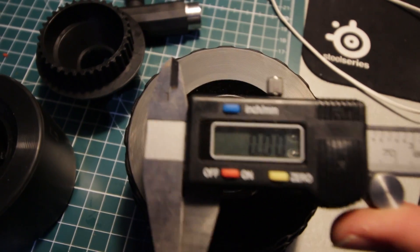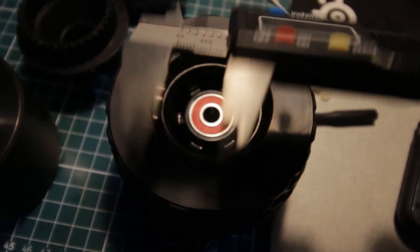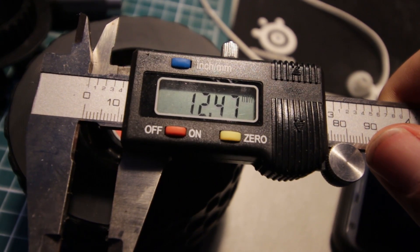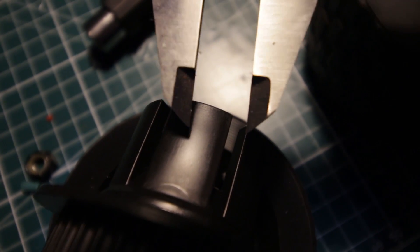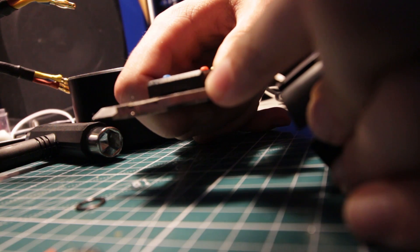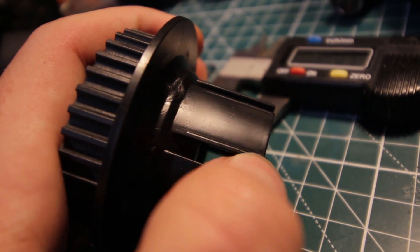So what we're doing here is we've got a pair of calipers. The top end is for measuring the inside diameter and the bottom end is for measuring the outside diameter. We want to measure the inside diameter — how much space do I have for the teeth to fit in? Looks like we've got 12.47... 12.5-ish. Now if we don't move it, we know what the outside portion is. Draw it carefully — you'll scratch it — and that'll be your mark of how far in to cut.